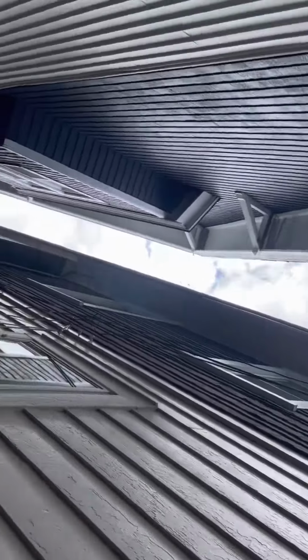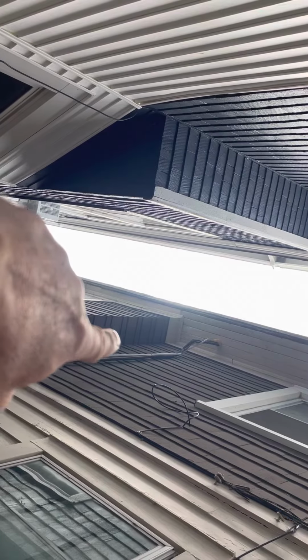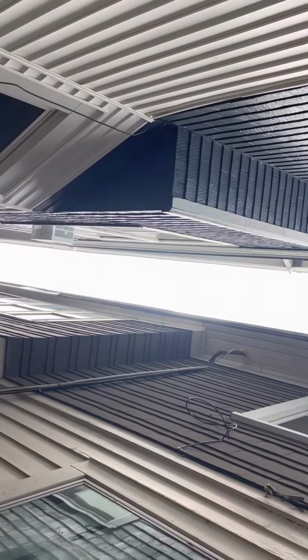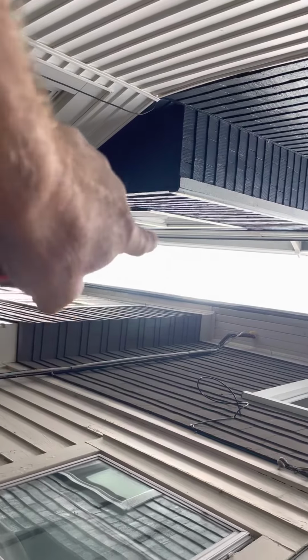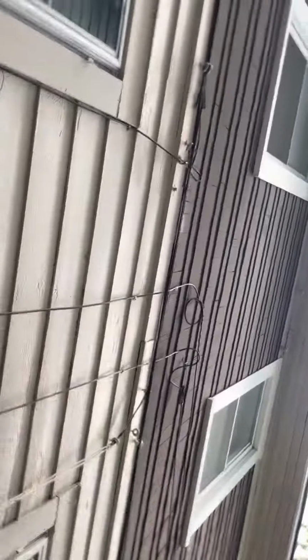And it's 24 foot to the bump out here. So you're gonna come measure down 4 foot from the soffit, come out with a 4 foot 2x6, and come down at a Y and bolt it to the side. And then same thing, you're gonna come up to the side with an angle just to keep it from waggling. So that's gonna be 24 foot from that bump out to that bump out.